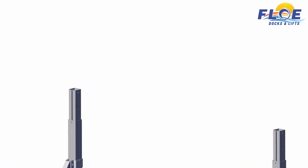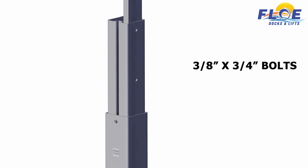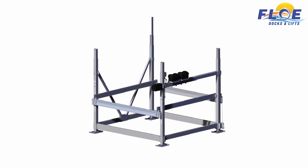Next, locate a canopy vertical guide. Guide the vertical guide into the rear canopy legs and align the holes. Place 2 3/8 by 3/4 inch bolts into the canopy leg and guide holes. Tighten and torque to 10 foot-pounds. Repeat this same process on the other side.